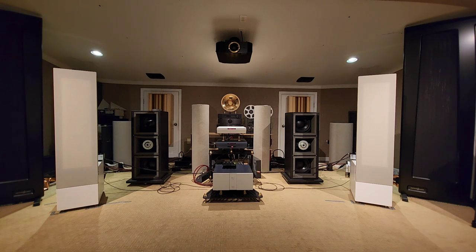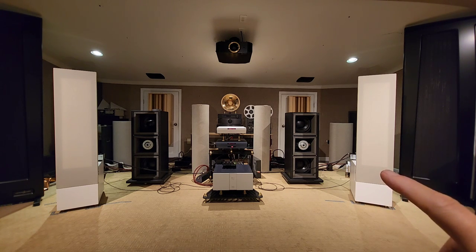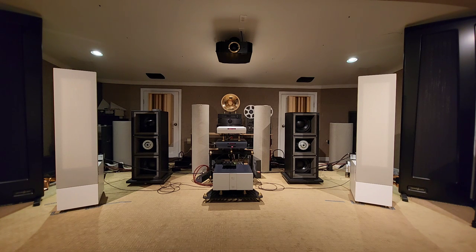I'm sitting here listening to what is a small version of the big rig — a fully active dual bi-amp setup with planar magnetics and a sub integrated. It also has the riser, which raises up the MagnaPans — which needs to happen with these little guys. They need to be 10 inches up or more so that you get the image, and they need to be perpendicular rather than leaning back like the factory feet, because you want the image going to your ears, not to the ceiling above your head. When they lean back, it points the image up and you're out of the image.